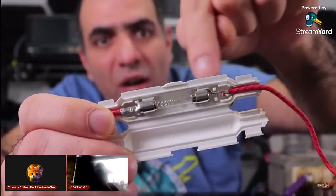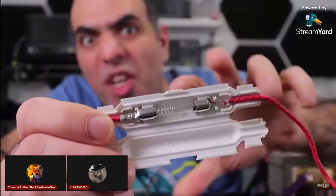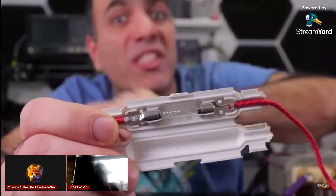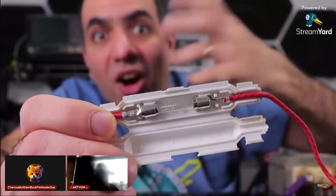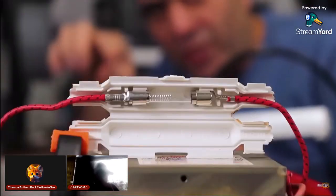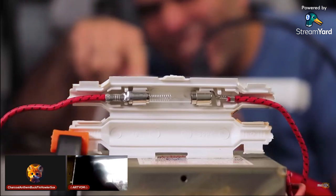See, the fuse wire on one side is a spring pulled open, keeping the fuse wire under tension. So when the fuse breaks open, the spring pulls the contacts apart, eliminating the arc, like what I did with my elastic bands. Okay, the fuse now is shorting the 2000 volt output. Let's see if it works as advertised.